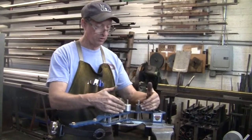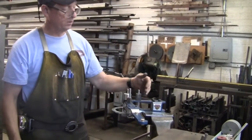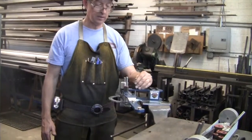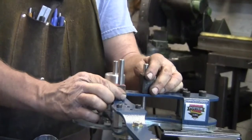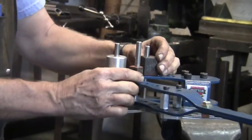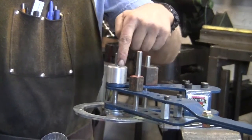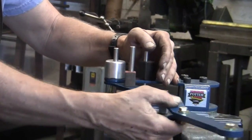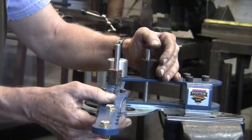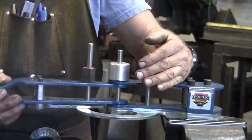What you see in front of you are the three basic parts of a bender: the clamp die, the form die, and the pressure die. When a piece of material is bent, it is held between the clamp die and the form die, and then the pressure die comes up to the part that you're going to bend — that's how you impose the bending forces upon the part.